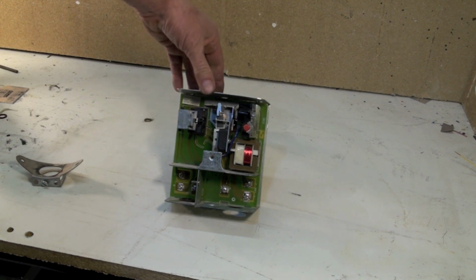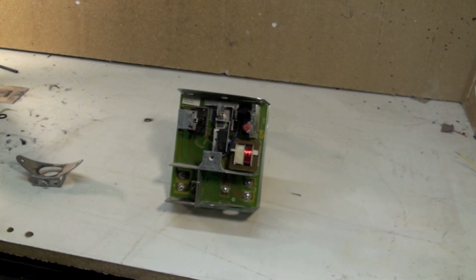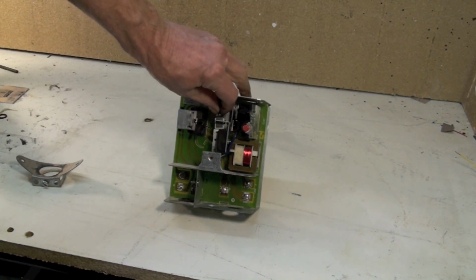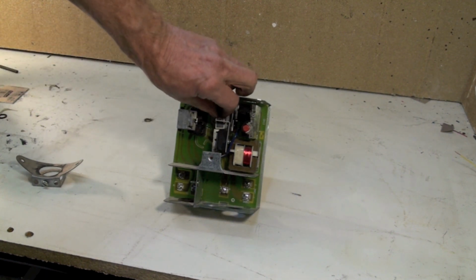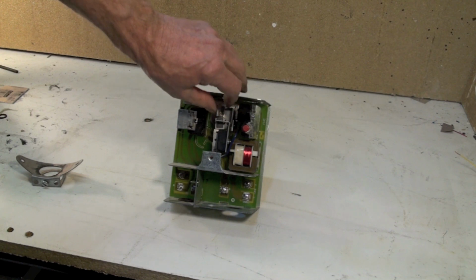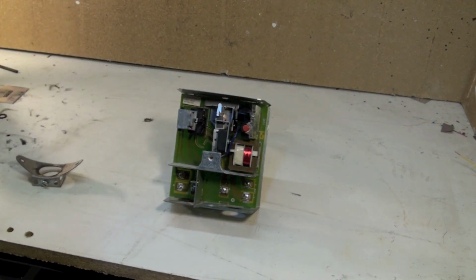When you take the stack switch out, clean it, and put it back in, it's probably going to be out of step. So all you really need to do is move this. Give that thing a little push. Sometimes I'll have to pull them a little bit, but give it a little push like that. Generally, it'll just start up immediately and begin working. So that's a stack switch.